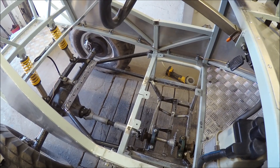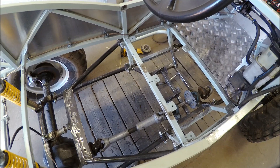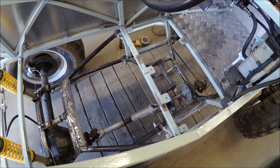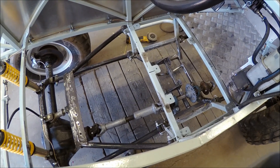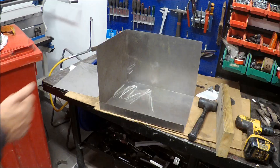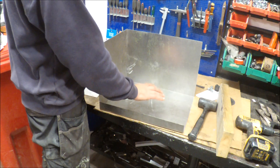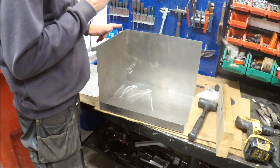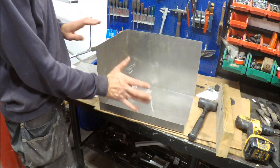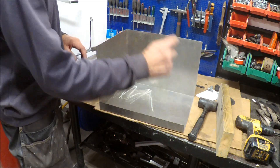After a lot of thinking, I decided to cut all tubes away for the seating and the fixing points for the old controller — it is always easier to start fresh. I must try to get these modules from the e-trike pack, and also the controller, relays, and everything, and I am trying to make this as tight as possible. This is the beginning of the box that is going to contain the battery modules. I will have one in the bottom, make some flanges to put the second one on top — two BMW battery modules underneath the seating. I will also make a plate in the front to make it somewhat waterproof, and there I will put the controller and main contactor.